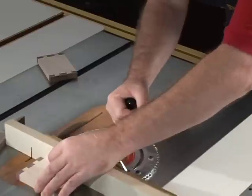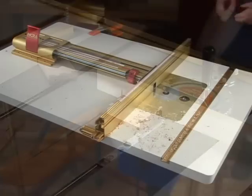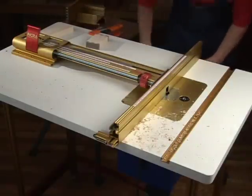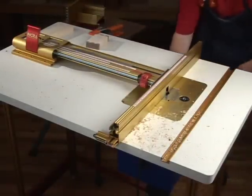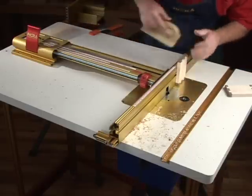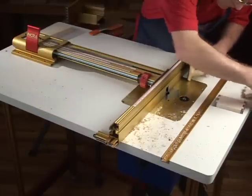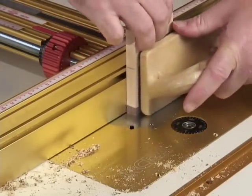From this point forward, we'll be using standard half-blind technique to join the four rectangles of wood. The pieces just made will be cut as the tailboards. Slide your LS to the scoring pass position at zero and clamp the carriage in place. The full rabbet width for the IDDD pattern is 7/32 of an inch. After making the scoring pass, make three subsequent passes of 1/16 inch to complete the rabbets. You'll find the rabbet width for your selected pattern listed under the diagram of the selection shown at the back of the Master Reference Guide.